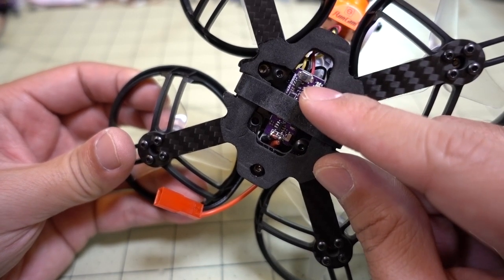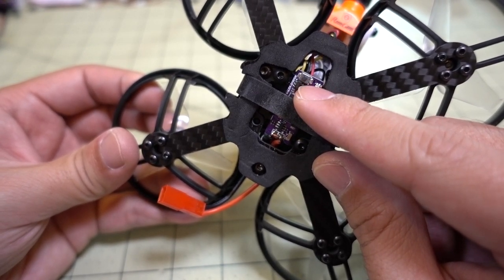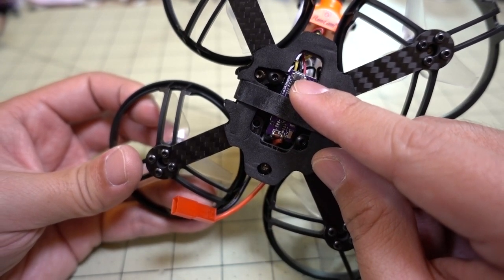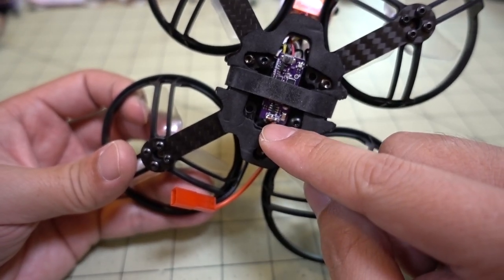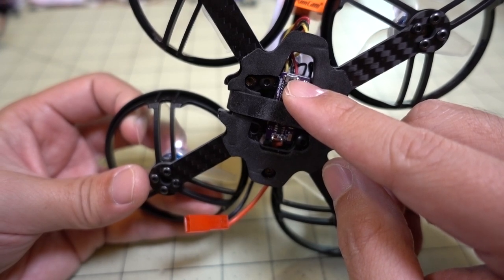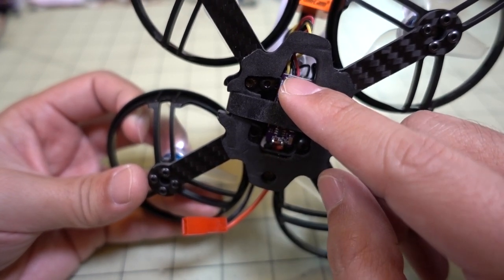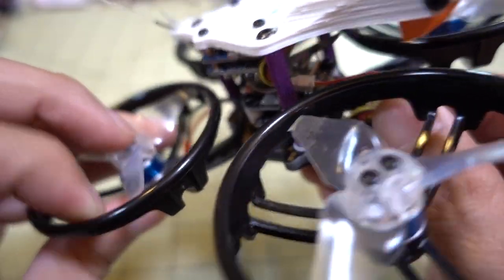This is basically the reverse plug. The current power coming out of that plug was 4.2 volts, because there was a 4.2-volt pad on this video transmitter. I just moved it over to the pad right next to it, which was the V-BAT pad. So there's a V-BAT pass-through — the battery connector is actually passing through to the video transmitter, so the video transmitter is powered by V-BAT. I soldered the positive over from the 4.2V to the V-BAT pad, and that's how the camera is being powered by V-BAT. It's pretty clean video, surprisingly. I left the video and ground the same as before, and that just runs up here to this little plug.